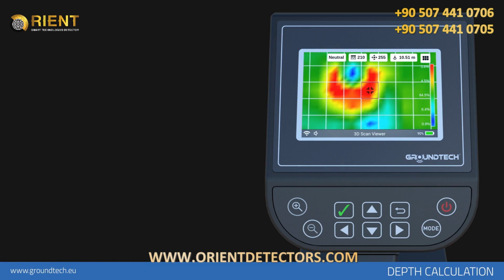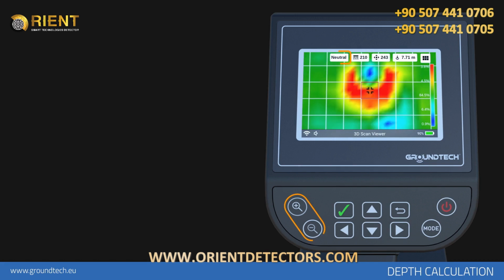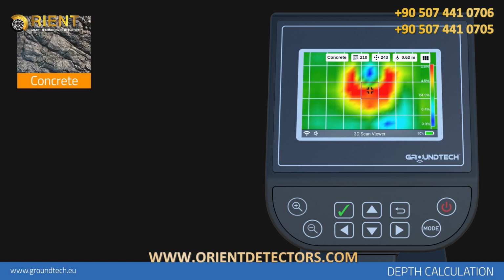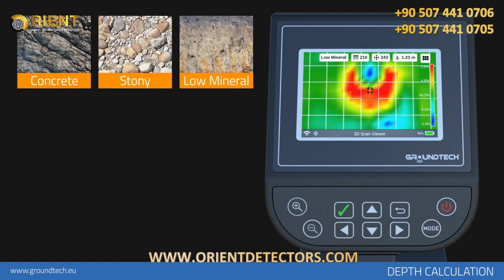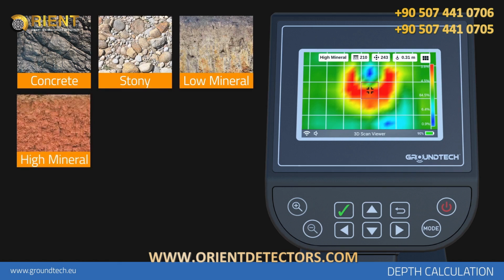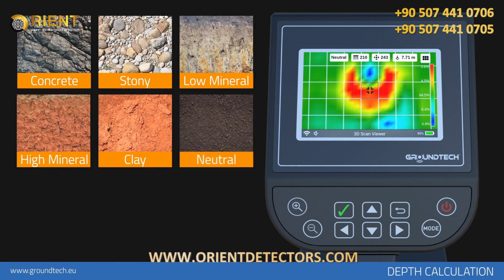You must select the type of soil according to the area you are working on from the depth information screen. You can select the type of soil using zoom in and zoom out buttons. For example, if the area you are working on is completely rocky, choose concrete. If it is stony, choose stony. If it is non-mineral, field-like, choose light mineral. If it has high mineral concentrations, choose high mineral.